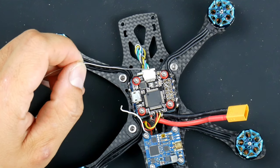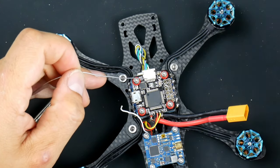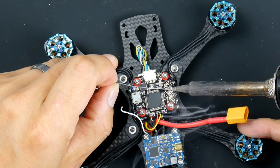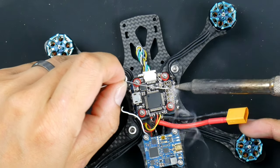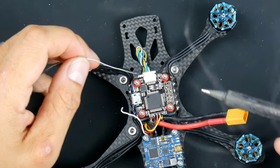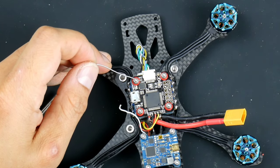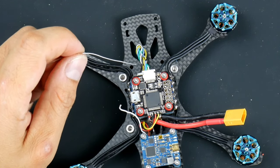All right, so I will be using S-Bus, so I'll be tinning that one as well, and that's on the outside, third one down. Okay. I think that balled up a bit too much. Yep, there you go. And the two 5 volts and the two grounds I'll be using, so I'll tin them